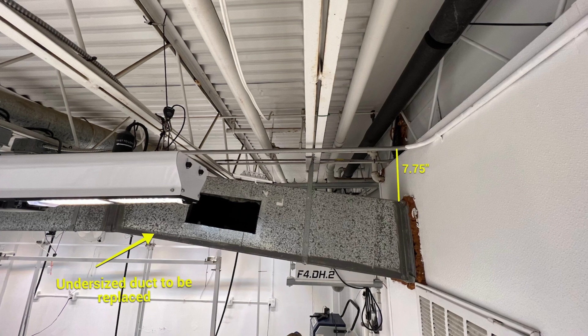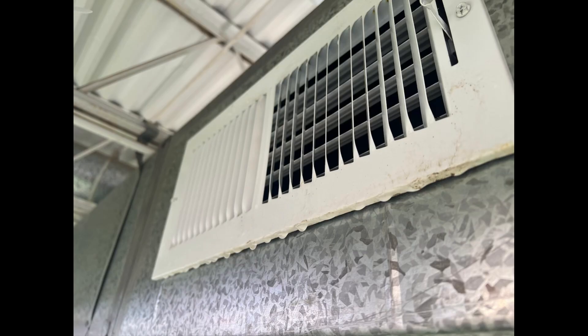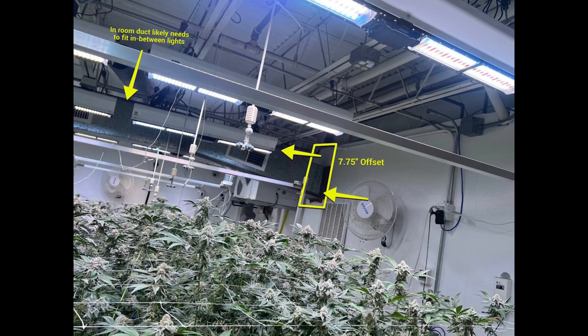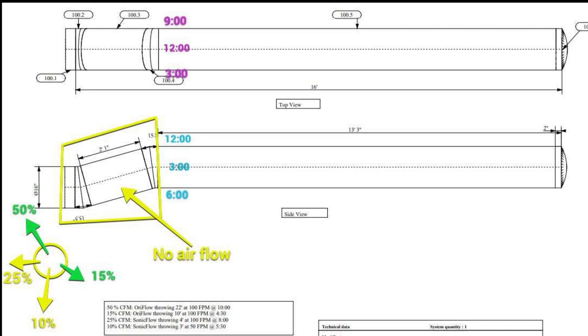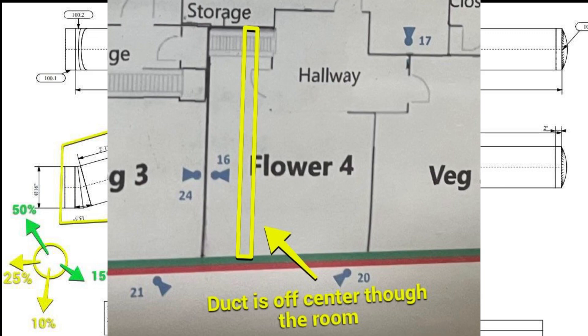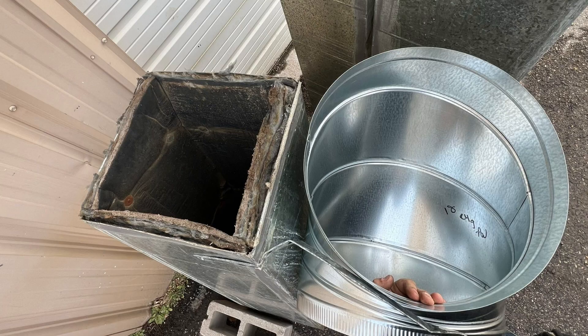We wanted to get rid of this awkward undersized metal duct — it was condensating all the time and just straight up undersized for the RTU, with a weird offset in it. So we got with our friends over at Fabric Air. They can make this offset directly into the fabric piece, and we had them design this airflow pattern to distribute the air, since we're not quite in the middle. While the duct was on its way, we went ahead and fixed the supply and return duct that feed the room, upsized it, and externally insulated it. Then the duct arrived.